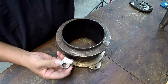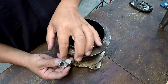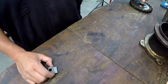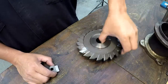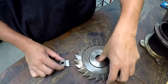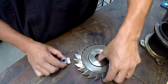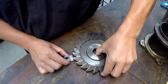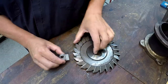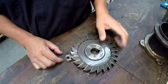And I believe this is 7 inch total. I'm sorry, not 7 inch, 3.5 inch radius is what that's going to be. What I want to do is take this big milling cutter right here. This is a 7 inch milling cutter, and we'll center up on this. We'll put this in the vise, and we'll center up on the cutter, and we'll come in there like that. We'll cut the bottom to cut the radius right there, and then we'll come up and we'll mill that step